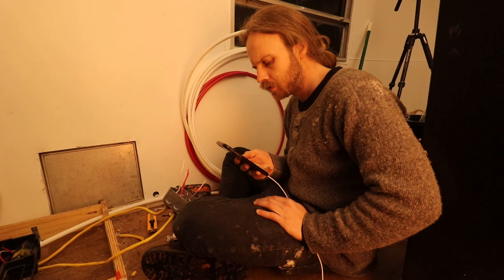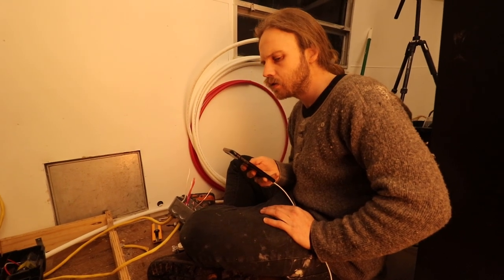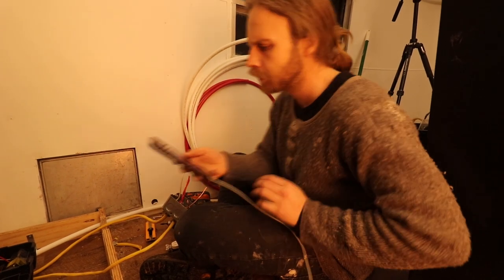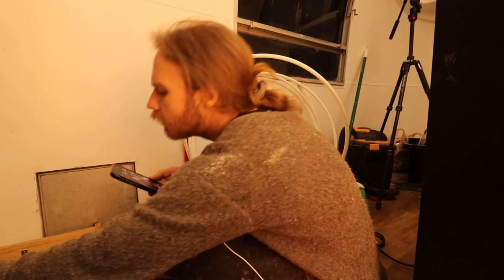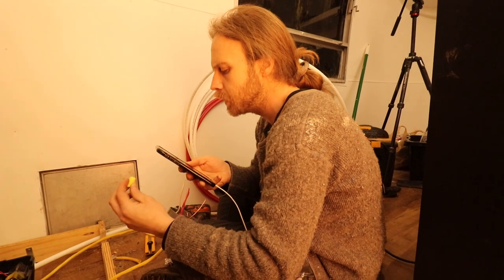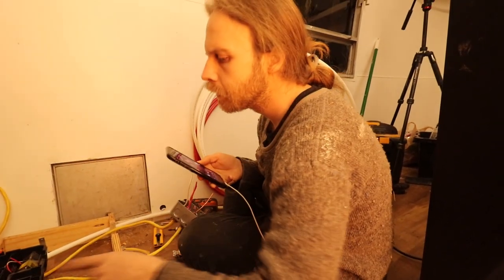And then as far as connecting them all together, they just put them red on top. The red is the way to go about it. And if I see you have those blue Wago connectors, those blue ones are what you want to use. Orange ones are too little for it, they will get really warm. So like, this is a yellow one, so that's probably too big? That's too big. Yeah, you want to use the blue ones on your left hand side. Right, gotcha.